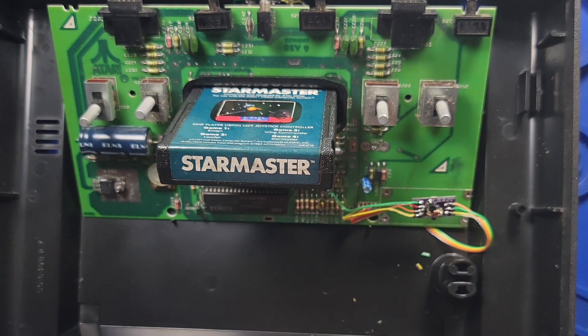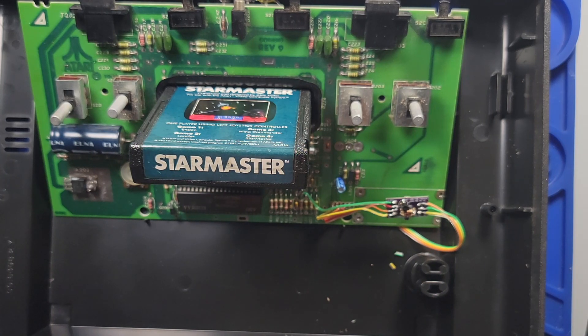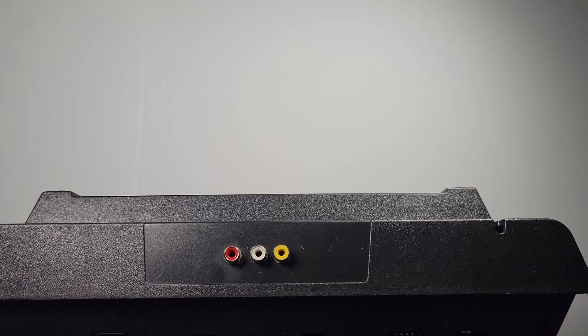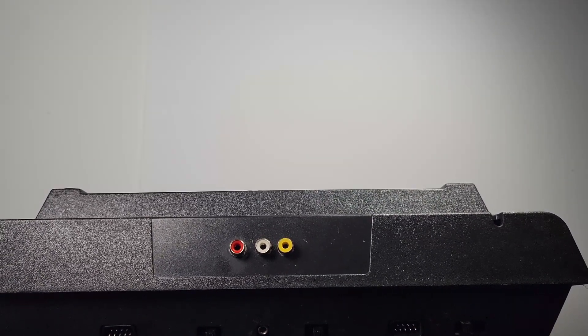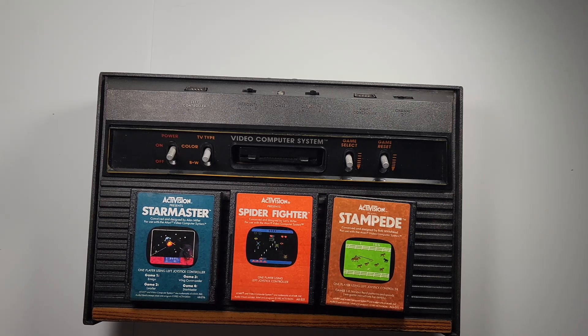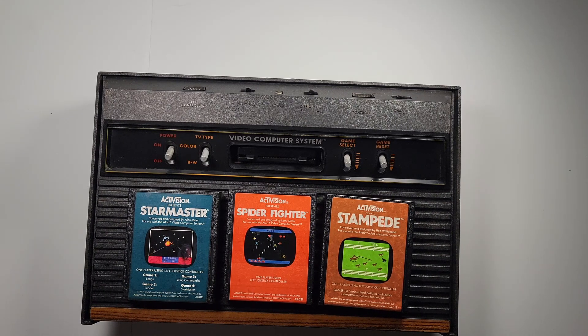The mod worked like a champ — I even have sound now, so there was clearly something I was doing wrong in the last video. Really simple mod to install. I'm going to put some tape underneath and hot-glue or foam-pad it down to secure it in place. This is the finished product — all put back together. It looks sharp for being an old device. The ports on the back look very nice. If you have a soldering iron, some flux, and some wicking braid, anybody can do this mod. Just take your time and think about what you're doing.